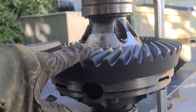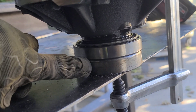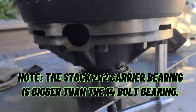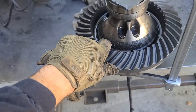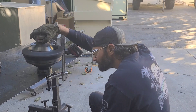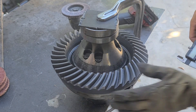I got the old carrier with the new ring clamped up. I have the regular 14-bolt races on the bearings and my Dana 46 races on top of that, with a piece of metal to hold it — same thing on the bottom. The reason I did that is because the 14-bolt bearing sticks out past the race, so this is just holding the race down. I'm going to spin it by hand and use the flat grinding disc to take it down as much as I can. As you can see, it's working.